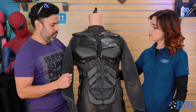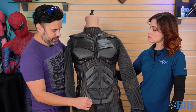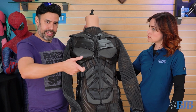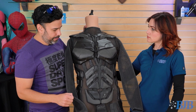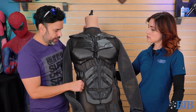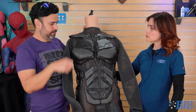So it gives you between 3 to 5 minutes to get everything into a good bond state. So if I'm working vertically, I pin the pieces down with needles, just to have a game plan and just go as fast as I can with the dispenser tool. Or if I need to go back and do just little edges and things like that, I pour in a cup and just kind of stir it with a stick and go in.